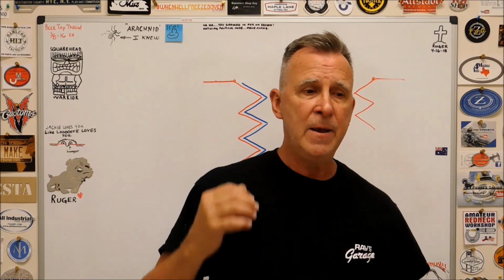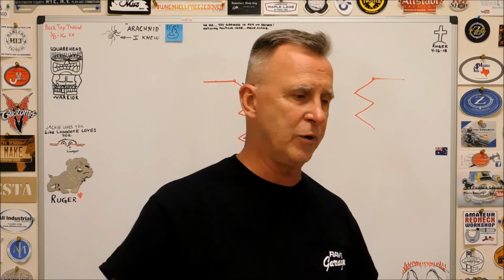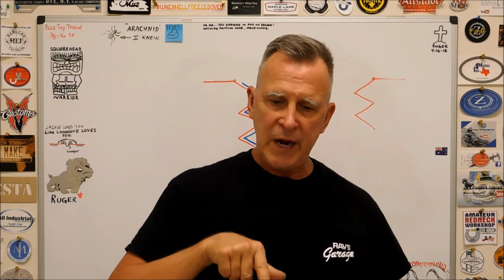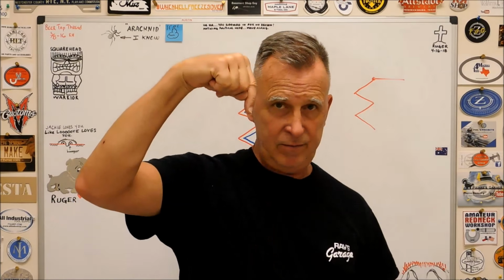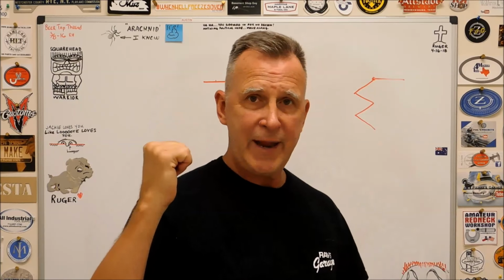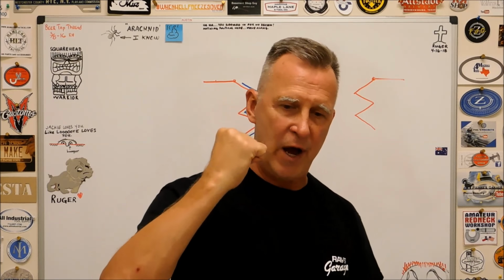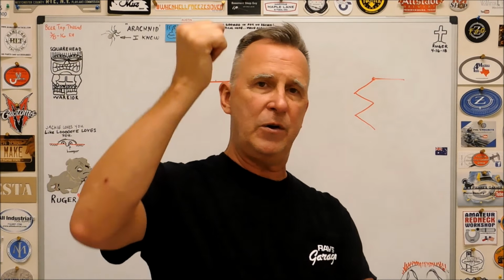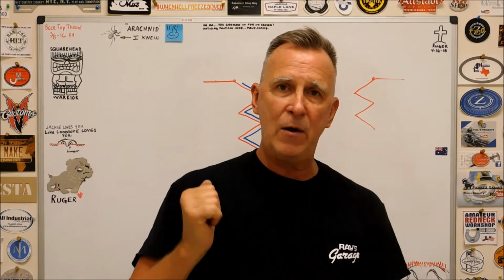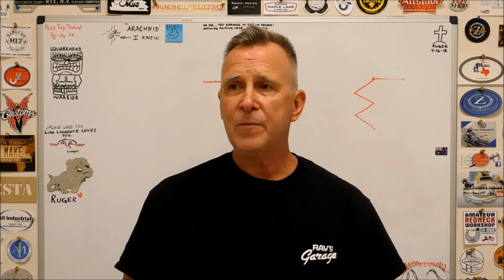But here's the but. As you're pulling down, drilling on a milling machine or drill press, of course, and that screw grabs, as the screw starts to come back up and you're pulling down, it's an immediate, instant amplification of the load on that drill. And if you can't feel that momentary, oh, here we go, here comes the rejection, and walk out with the stud, well, you're going to explode your drill, so be careful with that.